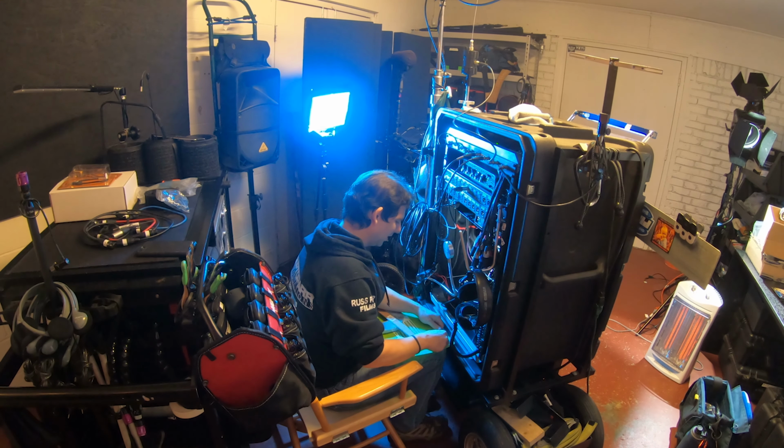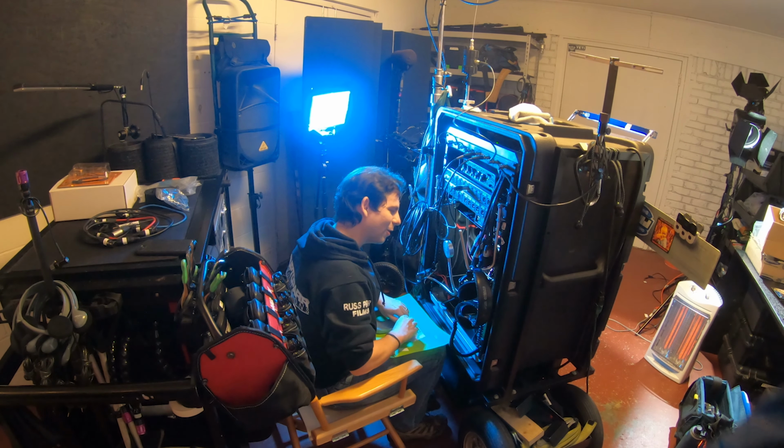And what's important about using a quality cable? What makes a quality cable versus a budget cable? If I had to wire something with Canare or Mogami, I'm not worrying about a thing. Okay. They're both great to work with. I love working with Mogami with the shield that wraps around. It's very easy to fan out, rather than the braided shield. If you've wired with a braided shield cable, it does take a little bit more work to get it apart.